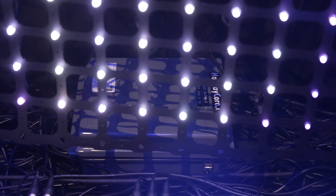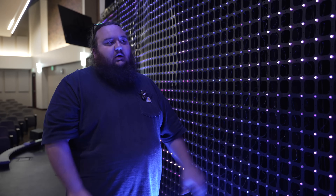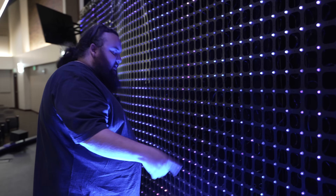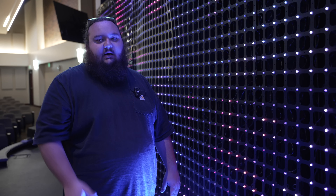There are four controller boxes. I also have two what are called long-range extenders, because once you leave the Art-net node the range is about 20 feet. They designed long-range extenders for scenarios like having an ornament across the yard without needing a whole new CPU. I'm using two of them — they're ancillary nodes that come off of the main nodes over Cat 5. So six total boxes, each with individual power supplies.